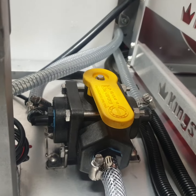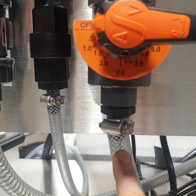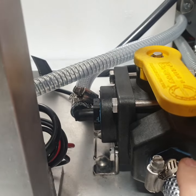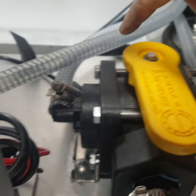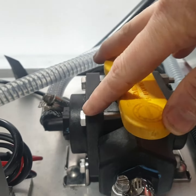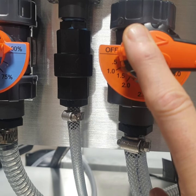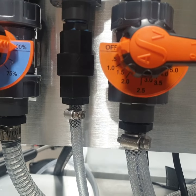It's a simple Banjo three-way valve right there and you make your common connection to your bleach valve. The common port comes over here, and then one side goes to your water tank, the other side goes to your bleach tank. This valve controls what comes through — whether it's water in rinse or flush mode, or bleach when you're applying chemical.